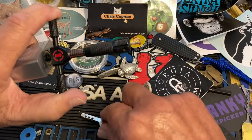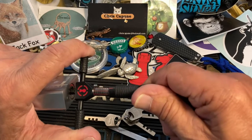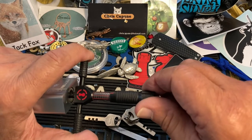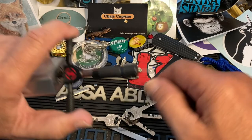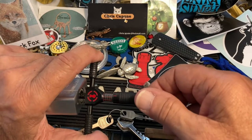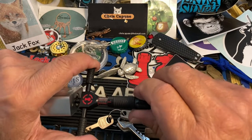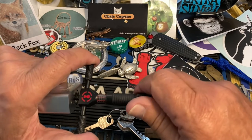The second one is probably a four or five cut, whatever their system is. So I'm going to rotate down until I get a click. I got a nice click — see the play? It's really the same play as we have on our zero cut. So the next one is going to be a zero. Make sure it's in the zero position. The next cut is going to be maybe a three cut, so we'll find it. Rotate it down — it's binding very hard and it didn't click, but sometimes coming back you get a click. We're going to look for that click and then look for the play.